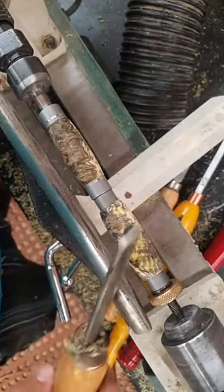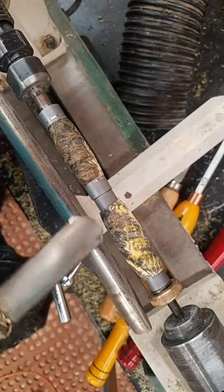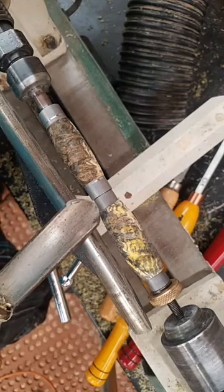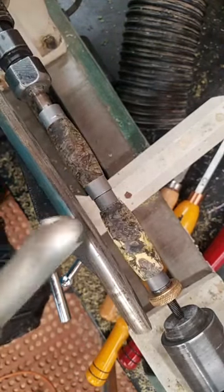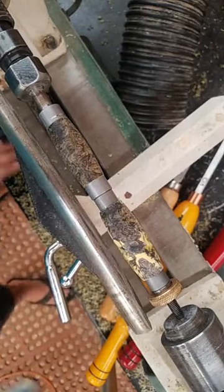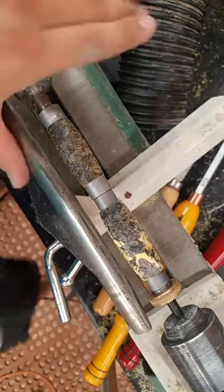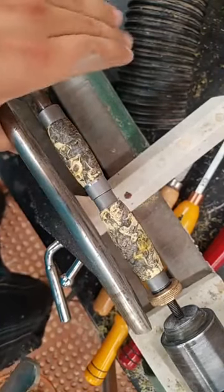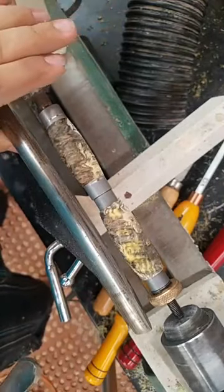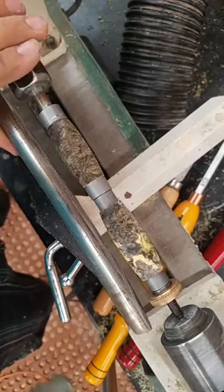Tell you a secret. When you got a horrible 90 degree grind, you set the tool below the center line of the piece. It's not correct by any traditional standards, but it's where this tool cuts the best. So I'm all about doing whatever it takes to have what you're using do the best job it can do. Don't follow some arbitrary set of rules because somebody said so. If it doesn't work for what you're cutting with and what you're cutting, it doesn't make any sense.